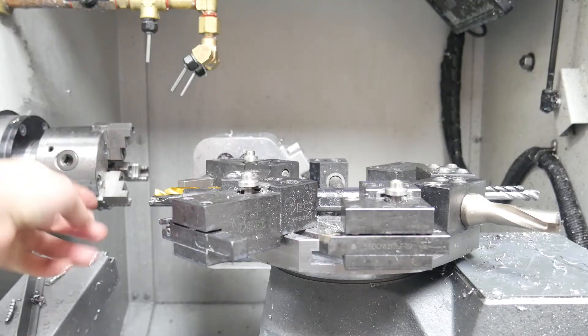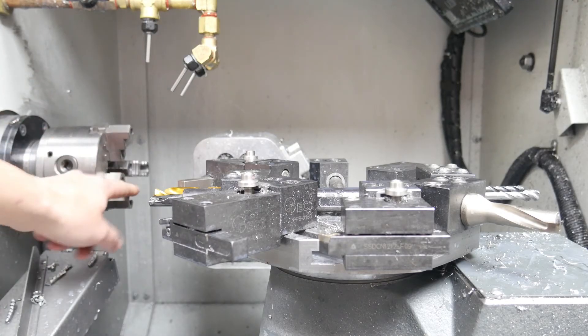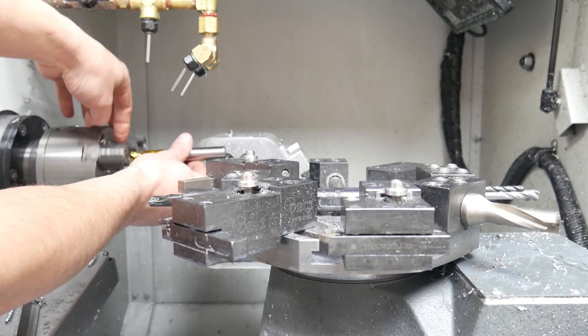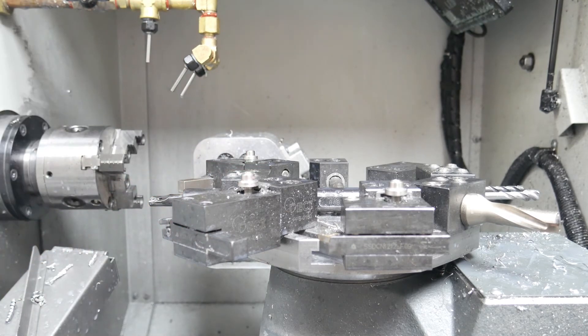It's great to get it fixed, but I don't understand how the machine could have come out of the factory 1.5 millimeters out — it should have been spot on. Maybe 0.1mm if it got knocked around in shipping, but 1.5mm is huge. On this type of machine the drill bit is static and the material spins, so imagine trying to drill higher than the center of the material — it just drags the drill around, which is why the tooling kept breaking or bending. I just found out we'll also have to redo all the custom little drill-bit holders we made.